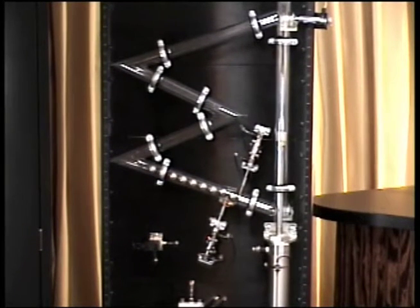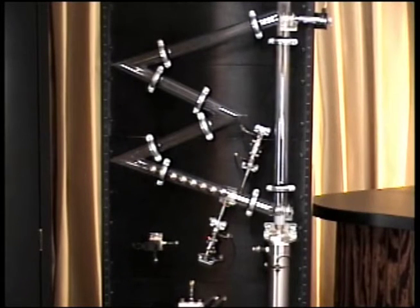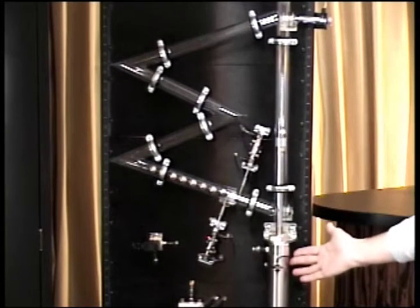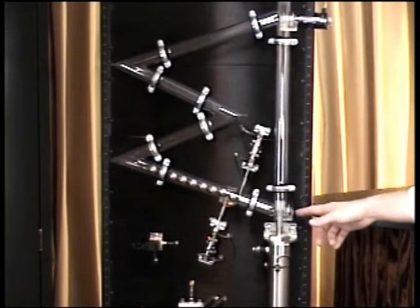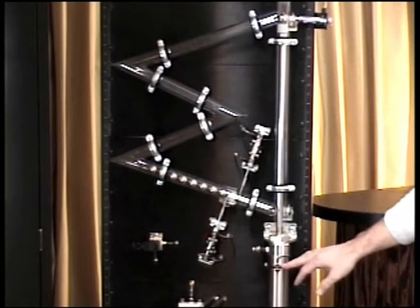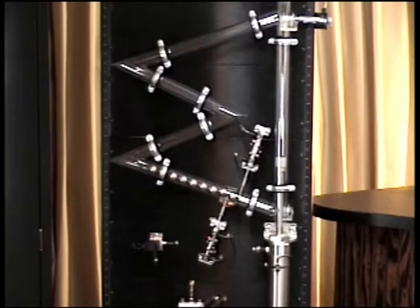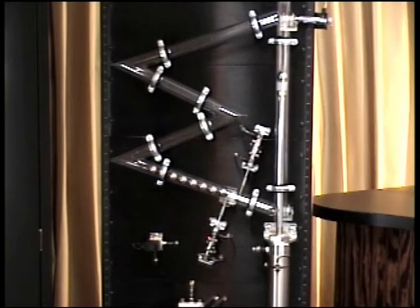Very simple design. We have some polycarbonate tubing with 1-inch steel balls. We have our 2-inch, 18-inch stroke cylinder with a little tool application on top, lifting the ball up. When it reaches the top, we have both sensors on the cylinders to tell us when we're up and down, but we also have some proximities to tell us the ball's in position at the downstroke, and also at the top stroke we tell when the ball's up there.